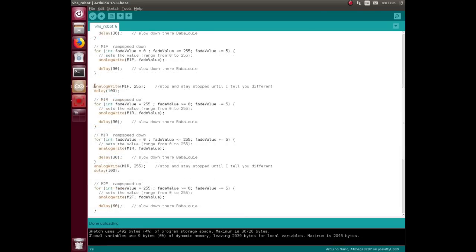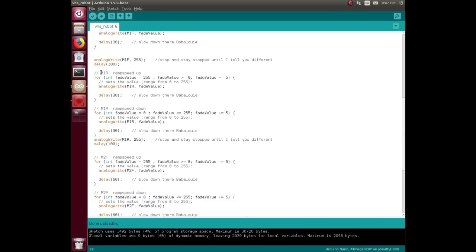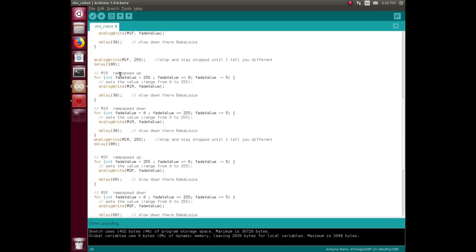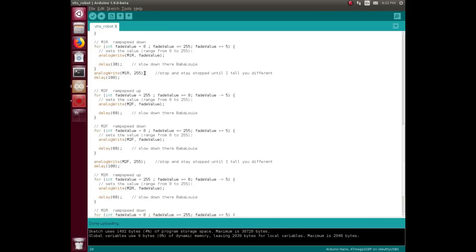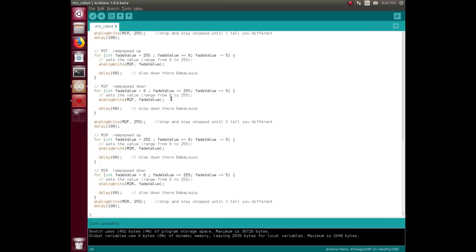And then I had a little bit of trouble early on. I may not need this anymore, but I put this in here anyways. So after it's faded up and ramped speed up and ramped speed down, I just set it to its stop value. And then wait, and then go to the other wheel and do the same thing. Then we wait 100 milliseconds, and then we ramp the speed up in reverse. Exactly the same thing, and we ramp the speed down in reverse. Exactly the same thing. And then we tell it to stop and wait, and then we go to motor 2